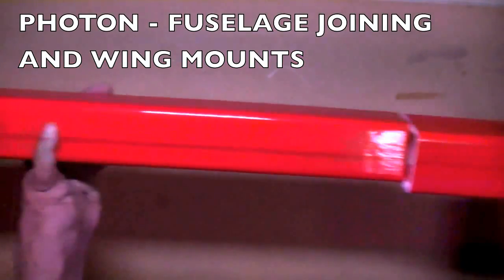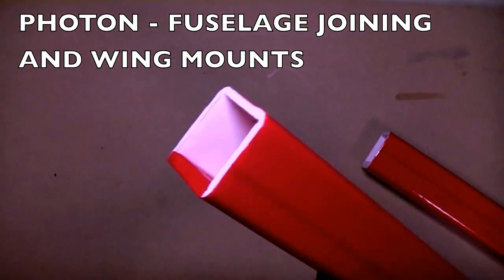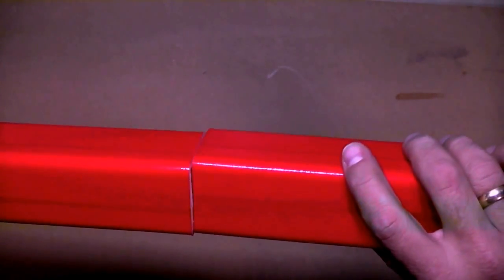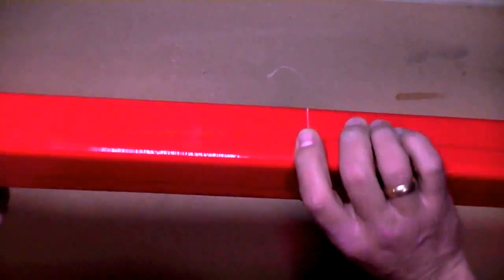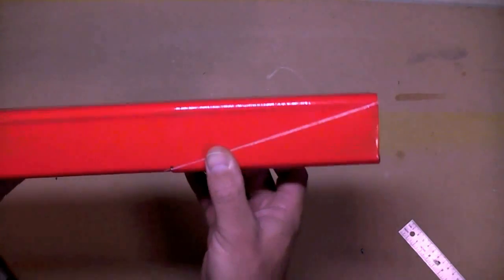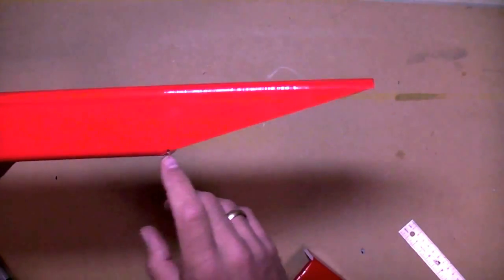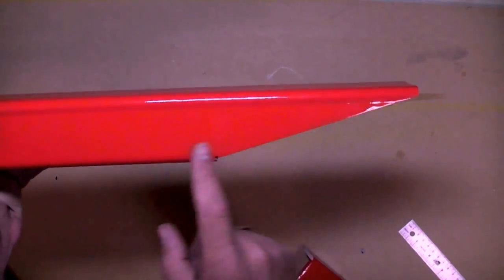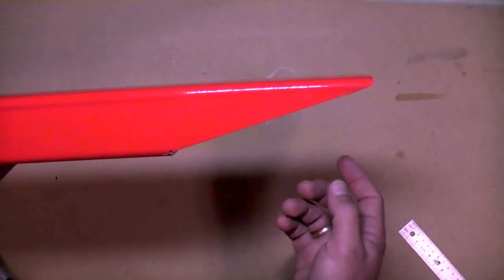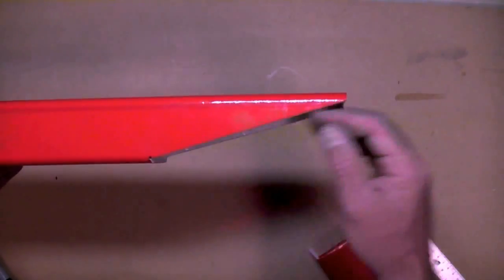Now I'm going to join the nose fuselage with the main fuselage sections and taper the bottom of the rear of the fuselage. Since this tube is the same at both ends, I'll compare the rear end of the nose section to the main fuselage and see which one matches up more nicely, make that the joint, and taper the other side. I've cut this back at a six-inch taper. There's really no wrong way to do this — I find this to be a nice angle aesthetically. Any shorter and it's harder to hide your servos; any stumpier and it's not quite as pretty. You do save a few grams of weight and it's presumably a bit more aerodynamic.